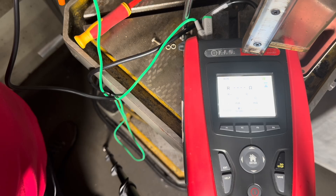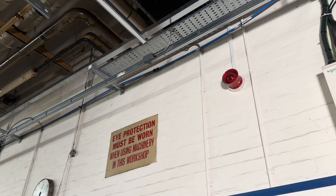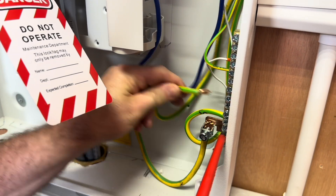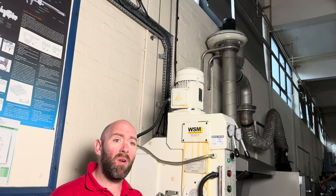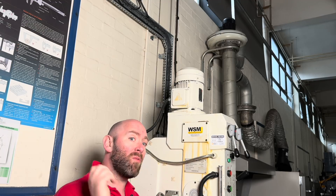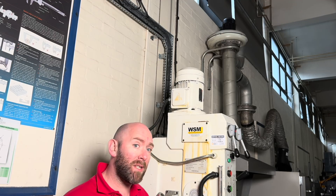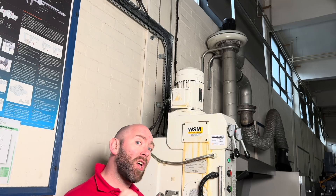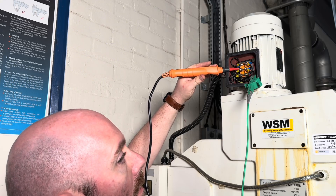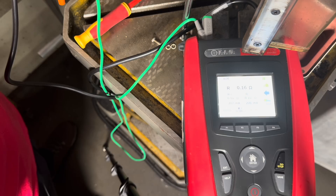But what happens when you're testing a circuit that's running in conduit and you get a ridiculously low reading even though the run is quite a distance from the consumer unit? The issue here comes back to parallel paths, which we explored in the second video. The path in this case is the metal conduit, so for us to get an accurate reading we need to disconnect the CPC from the earth bar or MET and link directly to the line conductor. This stops the conduit from offering a parallel path for the test voltage and current to flow through, so the readings are for the circuit only. For this three-phase motor, I can test between each phase in turn having linked out at the DOL starter, confident that the conduit, trunking, or cable tray are not offering an alternative path.